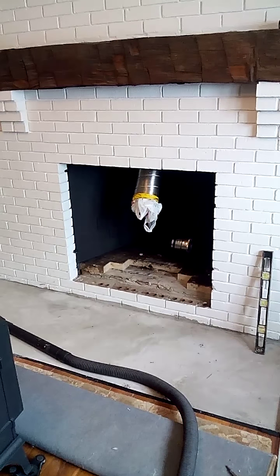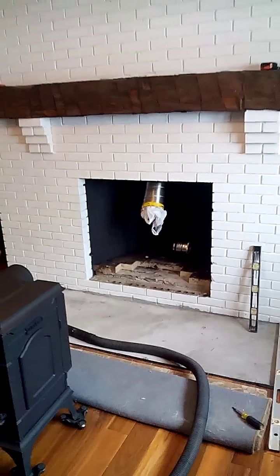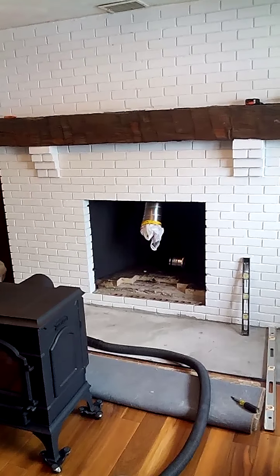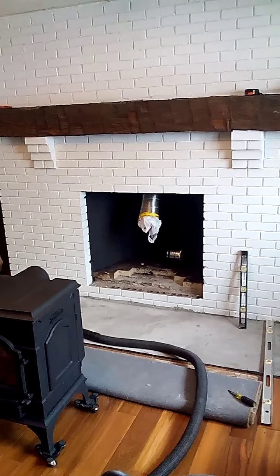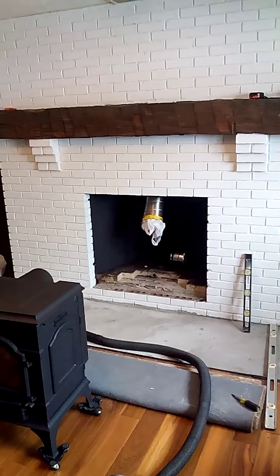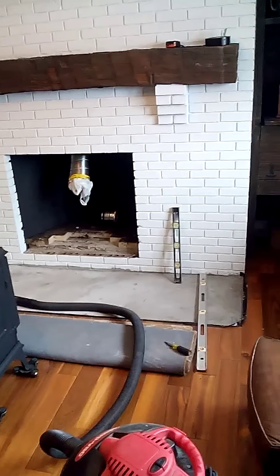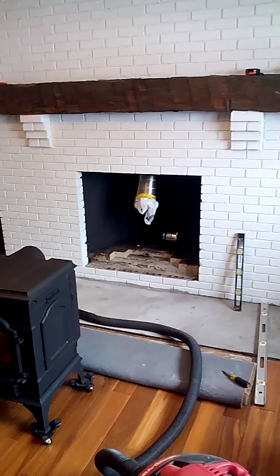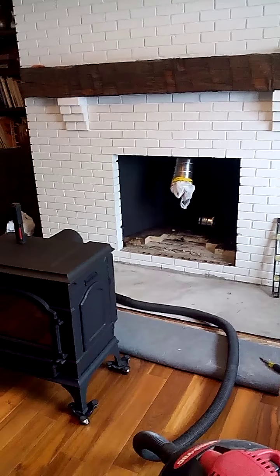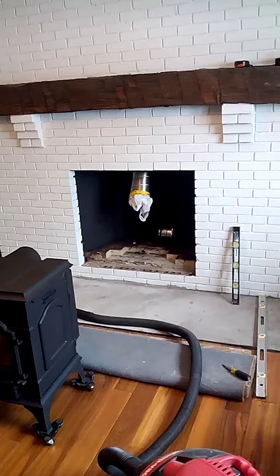So we're going to commence, and we know for a fact that this fireplace is in fact foundationed on a rock slash brick foundation. It is originally rock again, and it's still rock in the basement. However, it is a bit different. So we're good on the wood structure. As you can see, this is poured concrete haunch of the fireplace for the hearth. So we're going to take it down to the single level, and then we're going to tile in and then back into the pit, and then make our connections and be done.